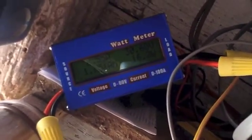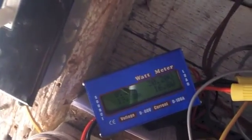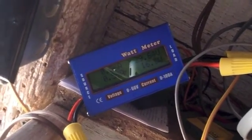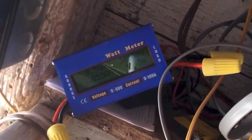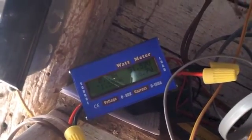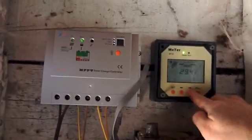I really should probably be getting a few more volts here. I have two 18-volt max voltage panels in series, so I should have about 36 volts in direct sunlight — and I am in direct sunlight — so they're not operating at their peak. They probably should be higher than 30 or 31 volts. They're all 12 volt car charger panels — the kind you'd put in your front windshield. This is the first time I've tried putting solar panels in series to test what it's doing and to see how the MPPT is going to work.